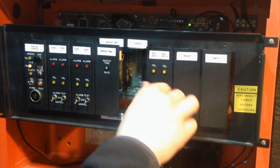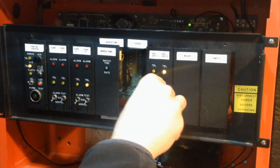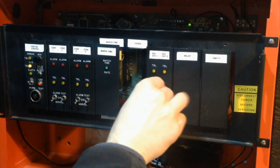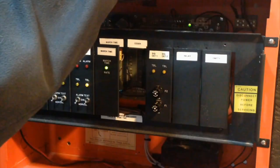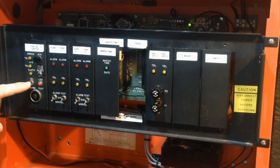If you put anything else in trouble, like if I were to put NAC2 into trouble, it would also apply power to the circuit. And like I said, once all the troubles have been fixed, like let me just put this head back up, it goes normal. Now you notice here, when it goes out of trouble, the piezo sounds again, you have to flip the switch back down. These are called resound panels, and a lot of older panels were like this.